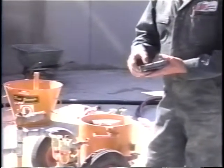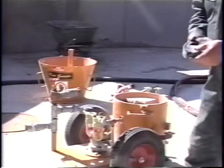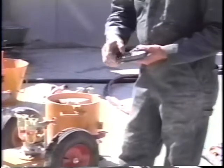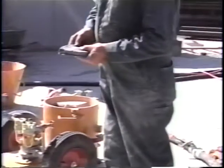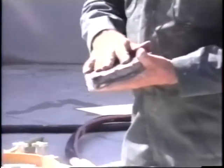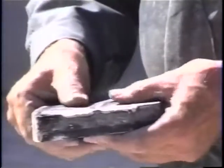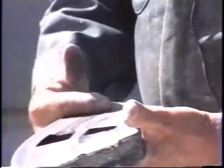If it had just grooves in it, it would more or less mean that you didn't have it tight enough, and it was allowing small particles to get in like a stream and just cut deep V's all the way across it. If it was adjusted too tight, then you would have just ragged edges. It could be all through here, just ragged, almost as if it was squeezed down too tight, allowing the tears to be erratic throughout. But this shows a very smooth wear pattern, and it's definitely more on the lead edge, and it's very smooth all the way through.